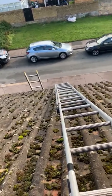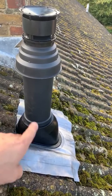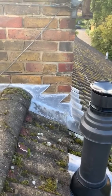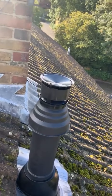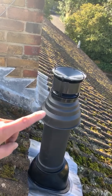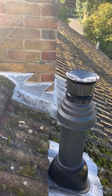So what we've got here — we have our roof ladders there, coming up, we climb up them. We've taken a tile out, just one roof tile, put our lead roof flashing through, tucked under the tiles so that's all weatherproof. We'll put our flue through. We're right next to a chimney stack, so as long as it's a non-working chimney — so it's not used as a gas fire or a wood burner or anything like that — we can be 500 millimetres away from that, have to be 500 millimetres minimum. If it is a working chimney then this flue has to be 1.5 metres away from that.